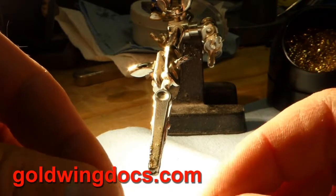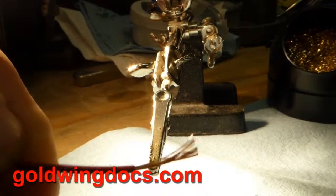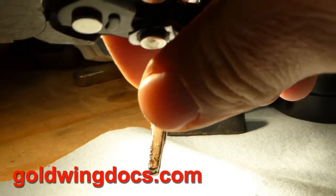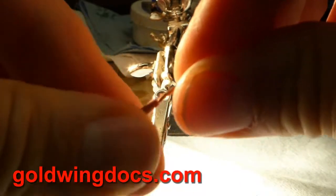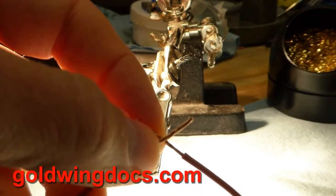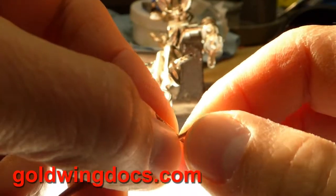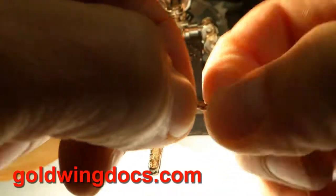This is very fine wire — about 20 or 22 gauge — and the thicker the wire the more heat you need. If I'm soldering a 14-gauge wire, a small wattage iron that you might get away with for 20-gauge wire is not going to have sufficient heat. If you do not have enough heat to complete the joint, you're going to end up with what's called a cold solder joint, or a solder joint that's oxidized internally — and that's bad news because it will fail at some point in the future.